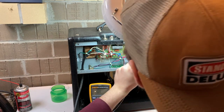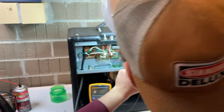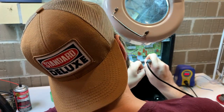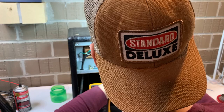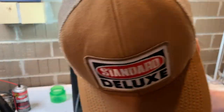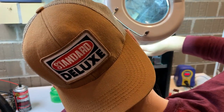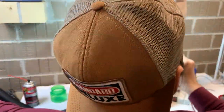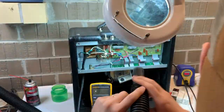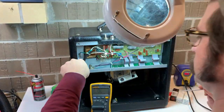Looks like there's some foil or maybe some metal shavings from manufacturing. I'll get that out once I'm done soldering, just in case I get a blob of solder. The other thing to keep in mind about these Fender tube boards is that if you change the tubes a lot or stress them out, you can actually break the pads off the circuit board — at that point you've got to go in and reinforce it. I've seen that happen on the hot rod series.